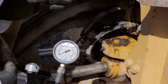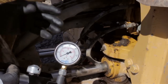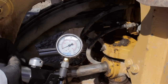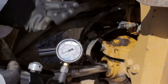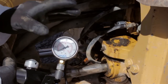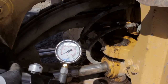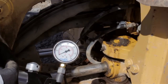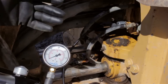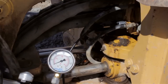We'll show you how to perform that isolation test on another video — it's better to do that on a bench in the shop with pictures and illustrations to explain exactly what we're looking for inside the valve. But we do know right now, based on this test, that there is excessive leakage in the A port of the directional control valve. Now let's test the cylinder just in case, because when you're testing in the field and you find a component is worn, there may be other components in the system that are also worn.